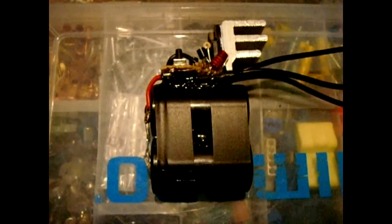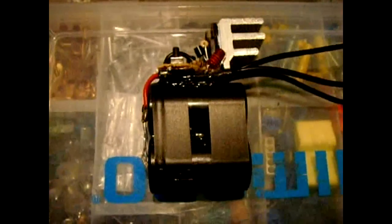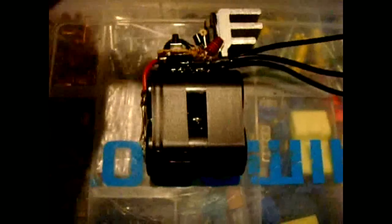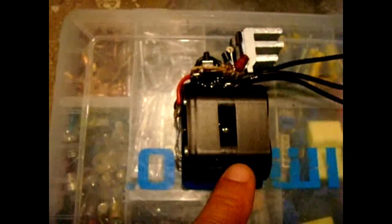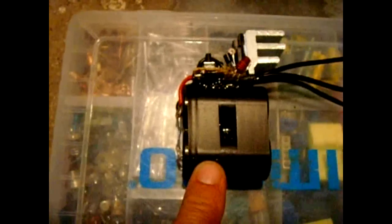So if you put a really strong motor on a lead-acid battery, the voltage will actually drop from like 12.5, possibly down to 10.5 or 11 volts. And what would happen is this circuit would trigger and then you would have an open circuit and everything would shut down, which is what you don't want to happen. So I added to the circuit — which it didn't have — 16,000 µF capacitors.